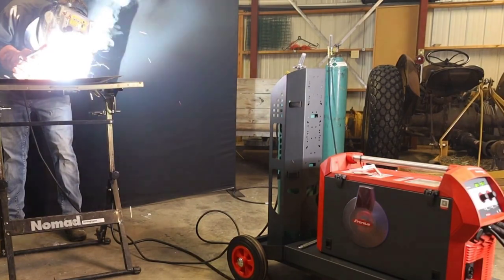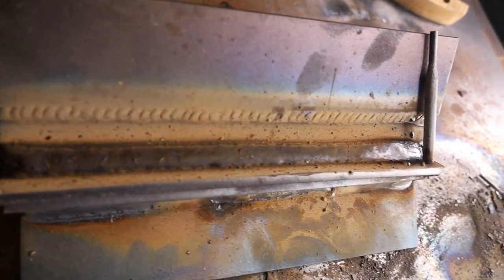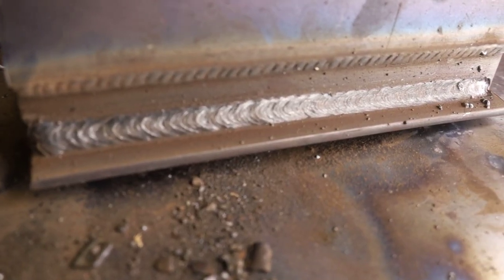And what's really nice about 5/32 is you can get double the fill. So if you're doing any type of multi-pass piping or if you're doing any type of bevel joints, 5/32 is really great for cap passes. So again, you're gonna wash it to the top and bottom, check it out. Still had a lot of rod left over after this. Give it a little chip. There it is.